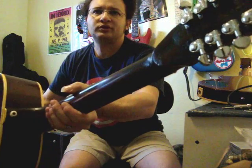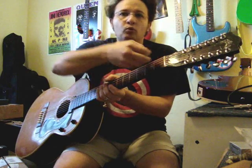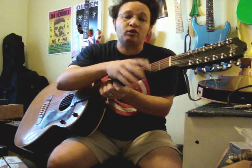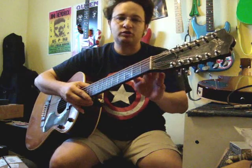I don't know if you can see them too clearly, but you can see the dowels that were previously used — it was a mess. Inside, where the truss rods are adjusted — there are two truss rods — one of them was full of epoxy that had just leaked into it from the way it was glued. I had to chisel out all that epoxy to be able to get to the truss rod nuts. I was able to clean it out and adjust them. The truss rods were not damaged at all, and it adjusted beautifully.